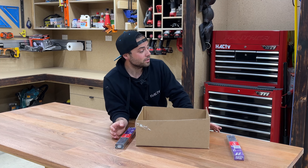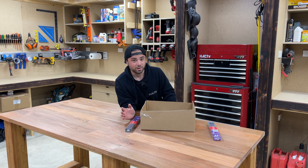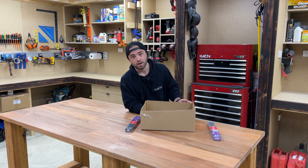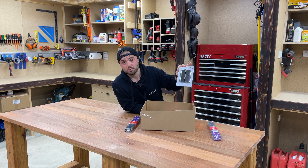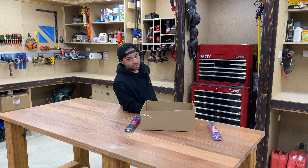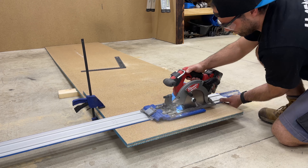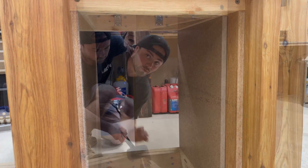What I'm going to do is build a box that will slide in underneath, and then I'll be able to build everything out on the bench and just slide the whole thing in and screw it into the frame. I'm hoping everything is square under there — I did check it a few times when I was building it. I've got some pull handles that I'll install on the drawer faces. I'm going to build this pretty much the same as the other drawers in the shed — just out of yellow tongue, sticking with the theme.